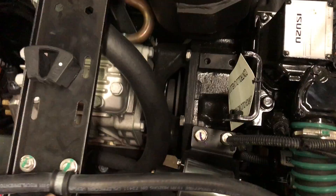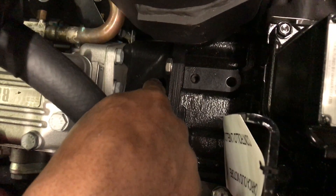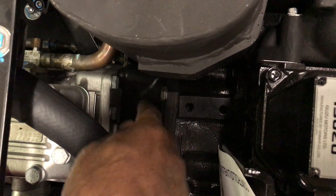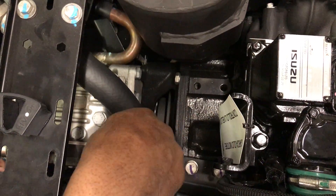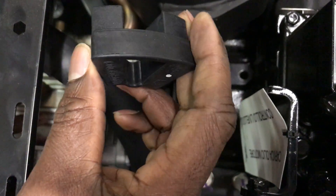If we move down — and this is what sets us apart from the industry — our direct coupling system. We don't have the belts and the gears and the clutches and all these things that wear and have to be maintained during operation. We have this coupler that couples the diesel engine with the compressor. Here's a look at the coupler and the Vibe Absorber right here that's inside the coupler.